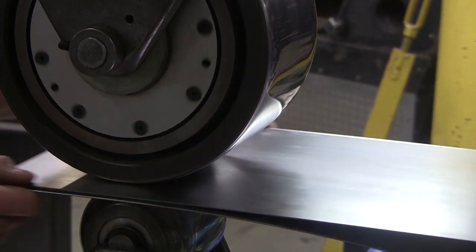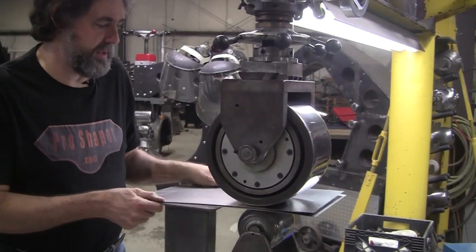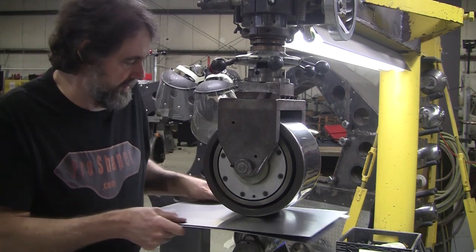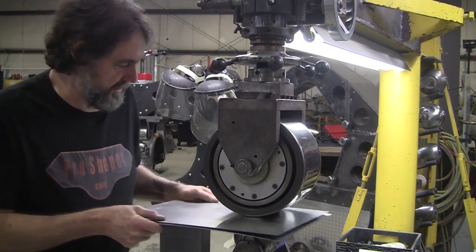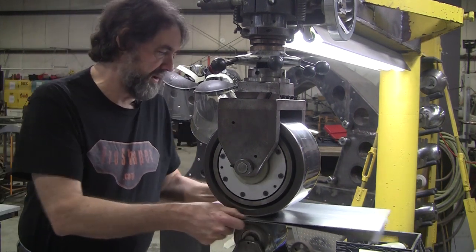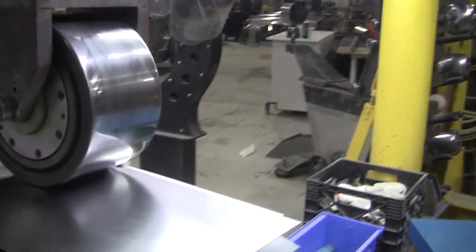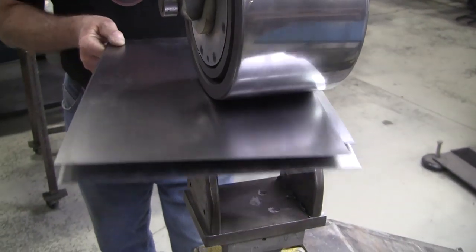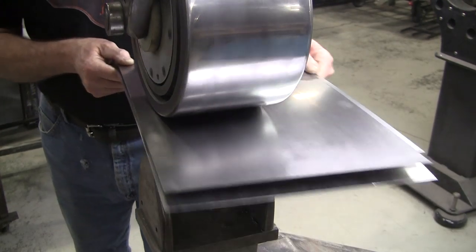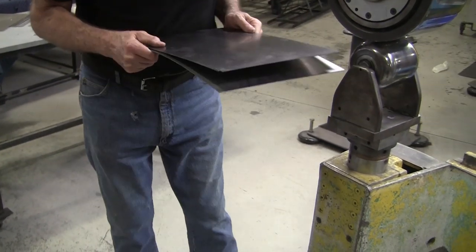I've got to make sure I get all of the border. I'll give it a little more pressure. That's a really good thing — you could make all these custom facia panels for a dashboard or step plates. As you're walking into the car, a nice step plate — you could emboss it right in, because that's what we're doing: embossing into the metal. You can do it with acid etch too, but this is the actual mechanical press pressing it in.